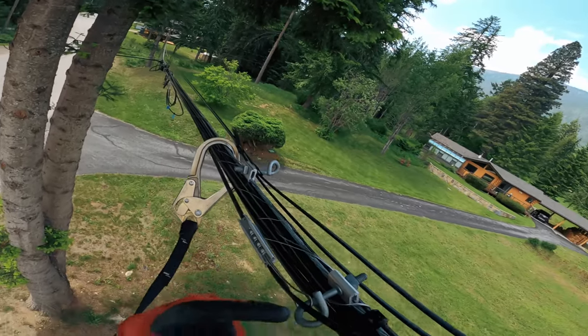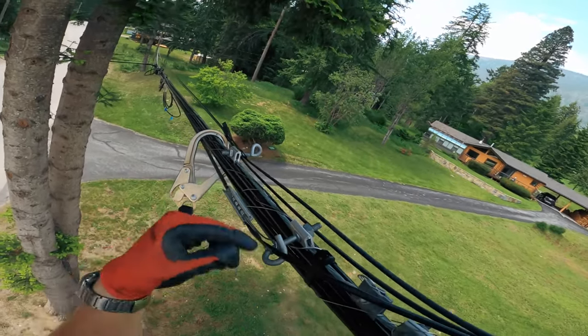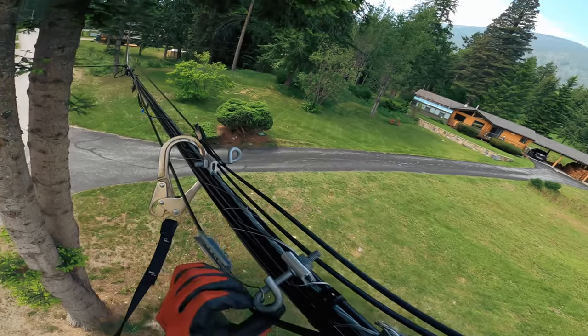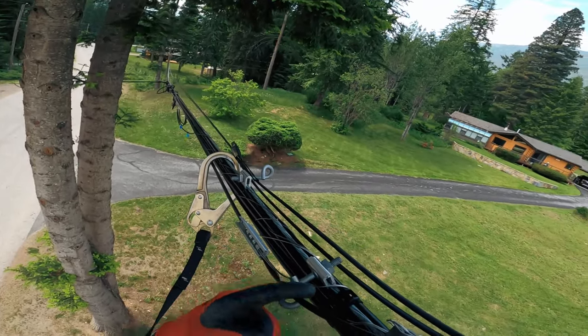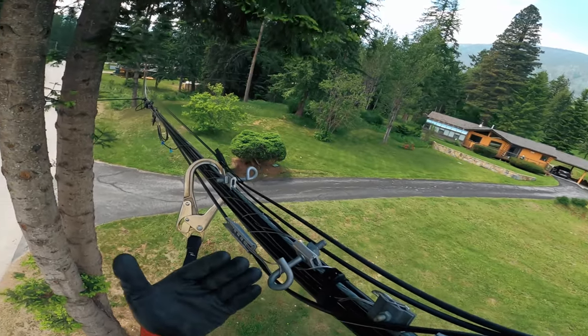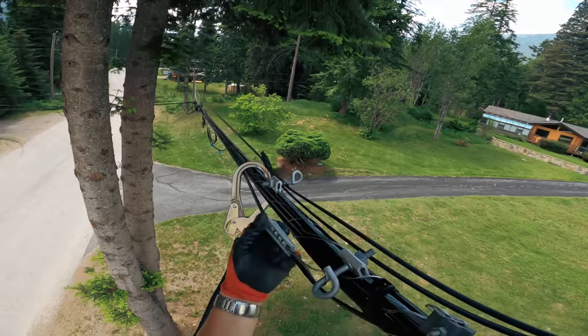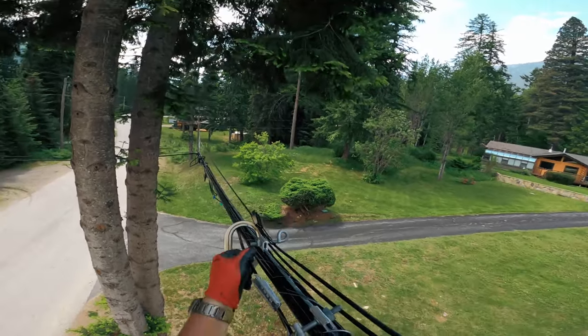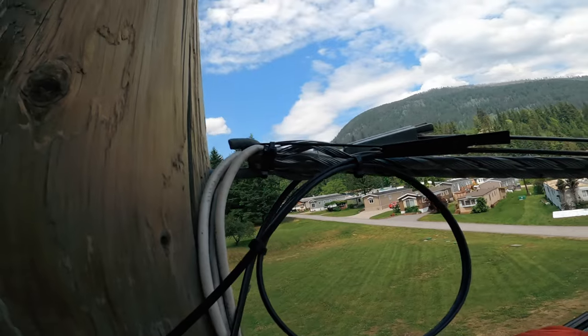Look at this, so bad. Tell me, viewers, this is how you put clamps, and that is a no. Why would you ever put a clamp sideways? Makes no sense. I understand that this hook would never come off the way this is, but look, does that look right to you? It doesn't allow the line to orientate properly or feed new drops through. And this is running roadside, which is wrong. But it's fine. I gotta stop being such a critic.